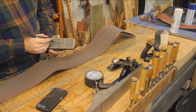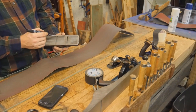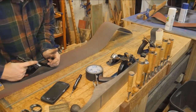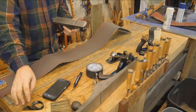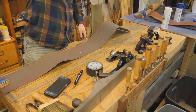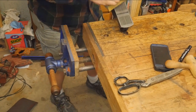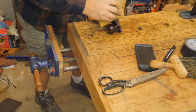One of the nice things about this plane is it is corrugated. Corrugated does not mean that it pushes easier through the wood, though it was advertised that way — it actually means that it is easier to flatten, which is a wonderful benefit. I put some Sharpie onto it, especially at the mouth, heel, and toe. With 30-grit sandpaper it only takes a few strokes and it is basically done. Then I take it onto 80 grit and all the way up to 220 grit, then finish with a sponge sander at 400 grit to clean it up. This is more of a polishing surface — it's not going to take it out of flat, but it gives it a nice clean surface so it's not nicking up the wood, and it looks very sharp with that final polish.